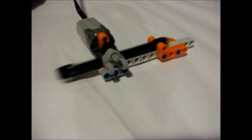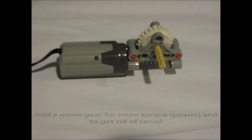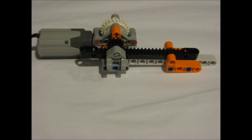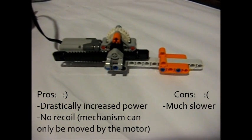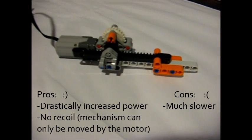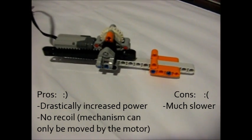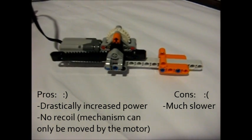When you're building, make sure that your pinion gear securely meshes the rack gear without any skipping. For extra strength, you can add a worm gear, which increases the gear reduction and reduces backlash. As you see in this video clip, the worm gear drastically slows down the mechanism but gives it a lot more driving torque or power, which for some applications would be very beneficial. It also gets rid of any backlash — if you have a heavy weight, it can't push down on the motor, and the mechanism will only move if the motor drives it.